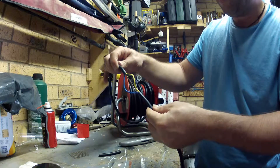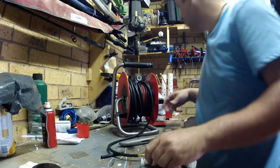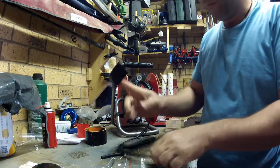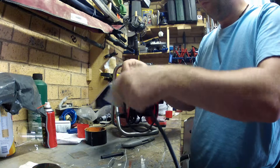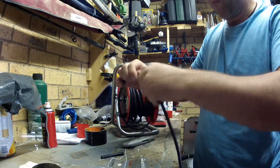And that's it. All you need to do is bare the three cores. You can't put a tong tester around three cores because the currents balance each other out — it basically equates to zero. So you have to bare the three cores, and you can either put the tong tester on a positive or a negative — it doesn't matter, because the current is the same in both.